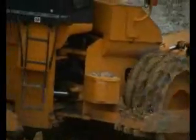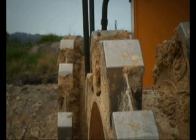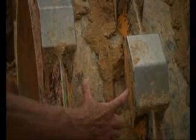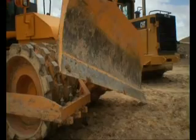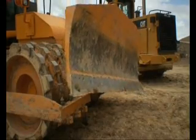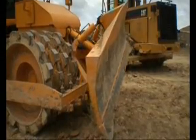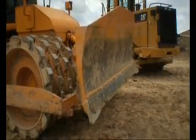The fourth reason does not relate to drag but it relates to productivity. We offset the drums so that every foot gives 100% efficiency. With the CAT, with the long narrow feet and drums following each other, the gap in between the feet is never compacted. With our offset drums the gap in between is compacted, plus we have a greater width. In addition, the 770 has a blade that is ahead of all others — it has a tilt of 28 degrees and a parallelogram lift.